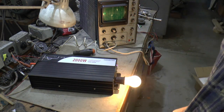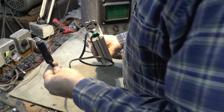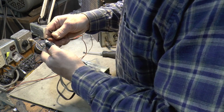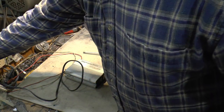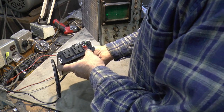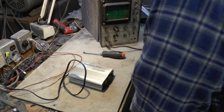Now we can mess with the yard sale find. Here's the yard sale inverter — 300 watts, Highwayman Travel Power. That's the only connection — I'm sure that's gonna handle 300 watts, right? Let's hook it up and see if it works. We got a green light. Power supply says we're drawing 0.35 amps. Let's plug in and see what kind of square wave it makes.